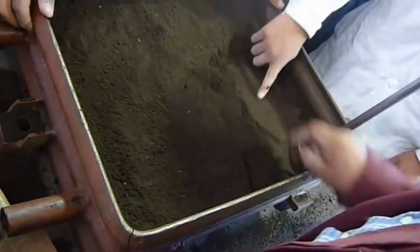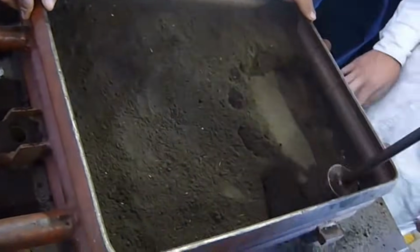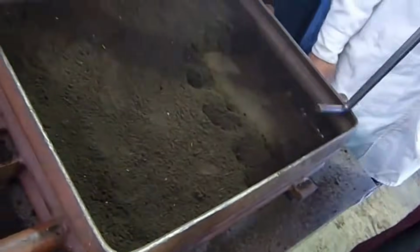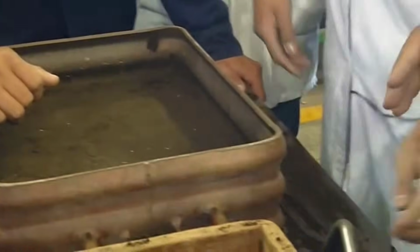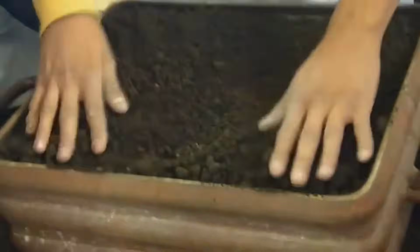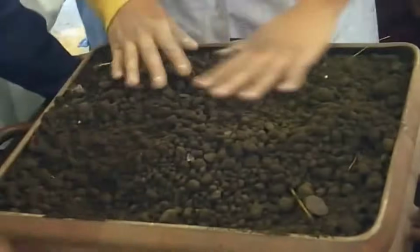The process continues with the creation of holes in the mold, strategically placed to serve specific purposes in the casting process. The addition of fine powder in designated areas further refines the mold's characteristics, enhancing its ability to produce the desired aluminum castings. As the mold takes shape, attention is given to the compacting of the green sand around the model. This is a critical step, demanding precision and care to ensure that the sand encapsulates the model entirely, leaving no room for error. Any imperfection or inconsistency in this phase could compromise the final product's integrity.